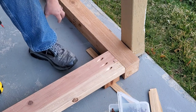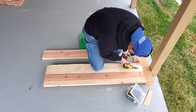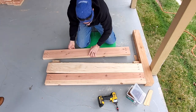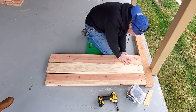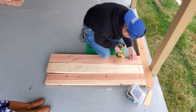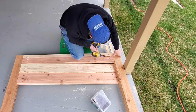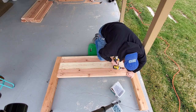I could do that with all three boards. I leveled this up because I want it flush — the other board's gonna come flush up against this side. I don't have a big enough clamp to hold this tight, so what I'm gonna do is raise it up and use this post to push up against it, then put my knee on it and screw it in so it's nice.